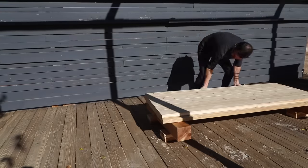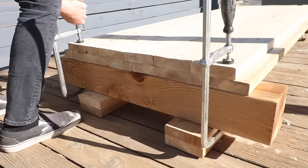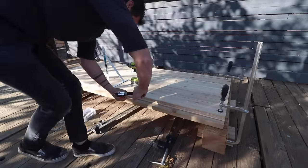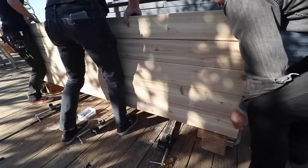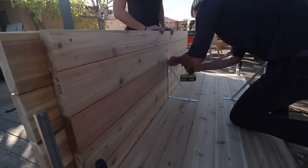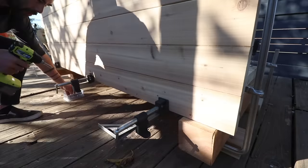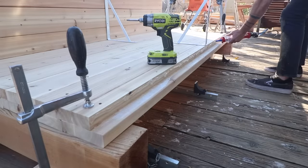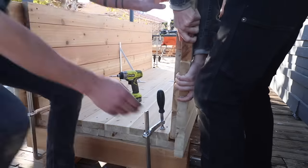These panels are mostly but not perfectly flat, so I cut some big pieces of cedar 6x6s and screwed some 2x6s underneath them to have a really heavy beam I could clamp the panels down to. The longer panels weigh about 60 lbs each, so I screwed in some right-angle brackets as temporary supports to get them at a nice right angle. Having two extra sets of hands was really helpful, as was having the 6x6 beams be a little long so the side panels could rest on them.